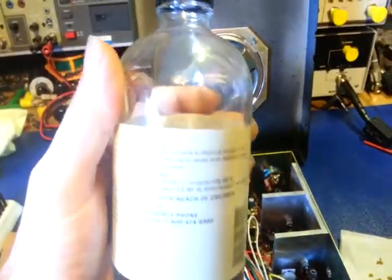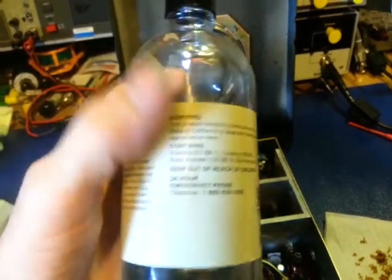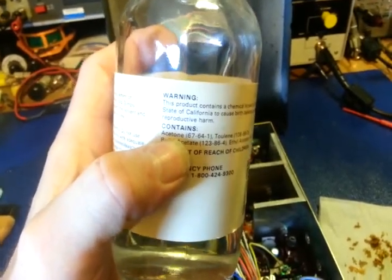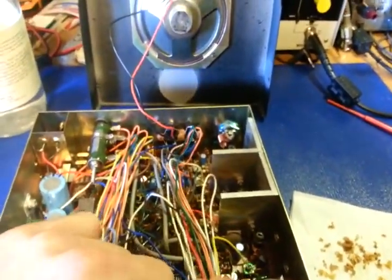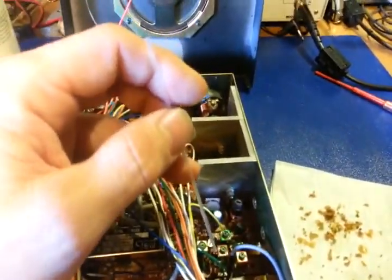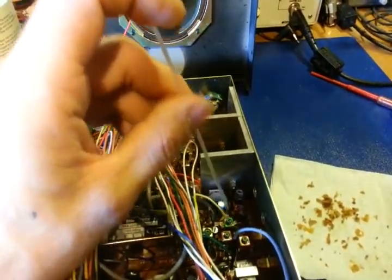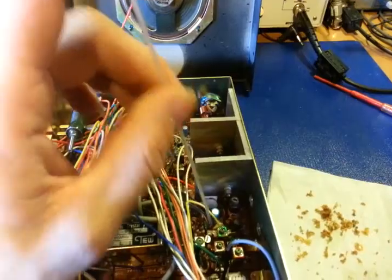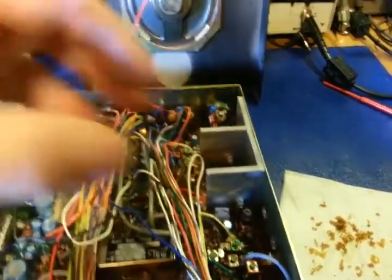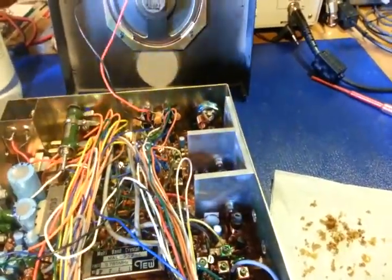You can see what's in this stuff: acetone, toluene, butyl acetate, and ethyl acetate. The main thing is acetone — that's going to be your main solvent. Just one or two drops on each one. Come back and reapply because it evaporates really fast, being acetone. Keep it lightly dampened and give it a minute — you'll see it start to bubble and crinkle, kind of like old crinkle paint, because it's softening up. Then once it's soft, go in with a dental pick and tweezers and get it undone.